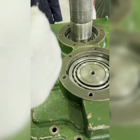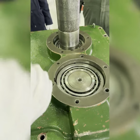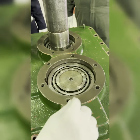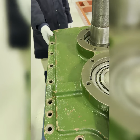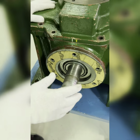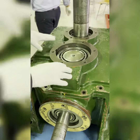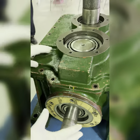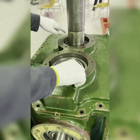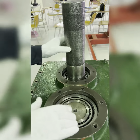You need to find the center of gravity. The cover's center of gravity should be maintained — for example, if one eyebolt is here, the other will be here. You cannot connect eyebolts where there is no threading. Now what's left is removing the upper body, upper cover, or upper casing. When you remove it, use eyebolts and try to balance it so it goes straight without touching the shafts.